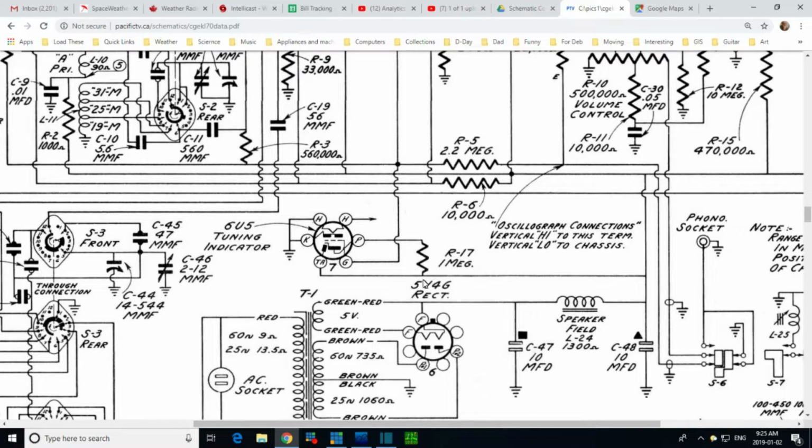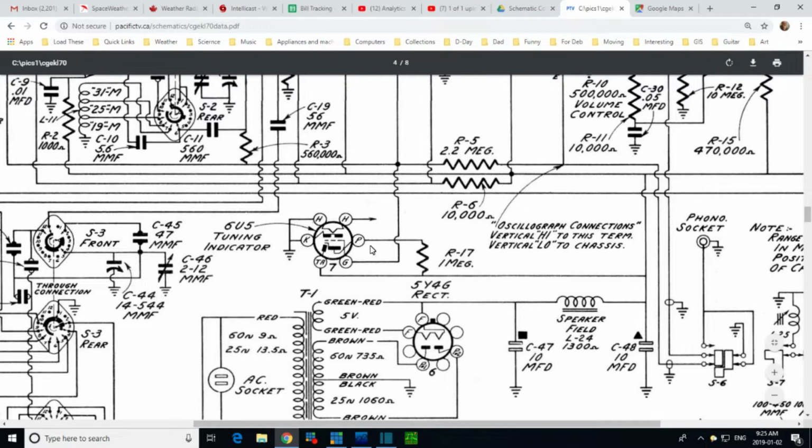Now, this resistor, it's not evident in the schematic here, but most commonly this resistor is tucked right inside the socket for this tube. And you can see the resistor is actually connected just between this pin and this pin. So why not stick it right inside? Well, one reason is it runs hot, because it gets hot from the tube. And second, I guess this guy's a little bit of a hard worker along with that. I'm not exactly sure why, but for some reason these very often are bad. These are bad guys.